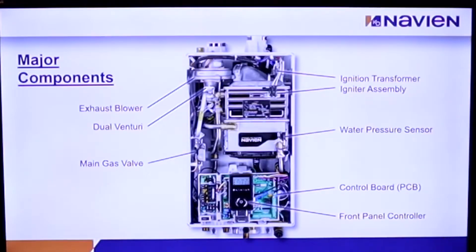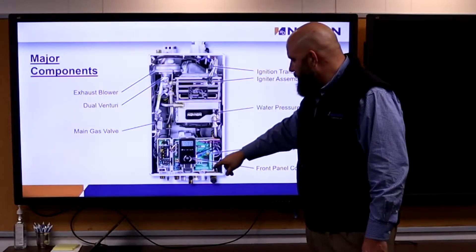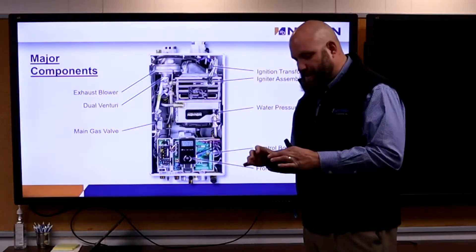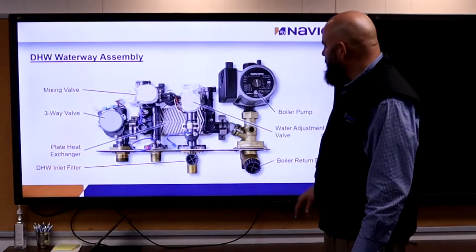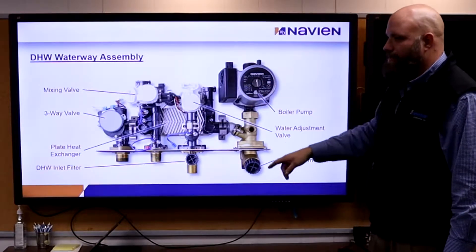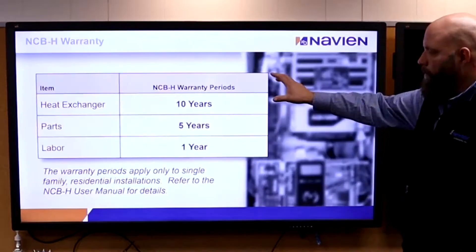What the inside of the machine looks like: we have our primary heat exchanger, our secondary heat exchanger, and then back behind this board we have our domestic water brazed plate heat exchanger. This is our brazed plate heat exchanger on our domestic water. This is our pump for our boiler itself — this makes sure the boiler gets enough flow to protect the boiler at all times.